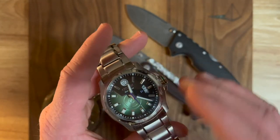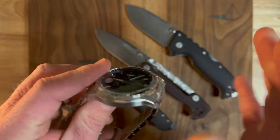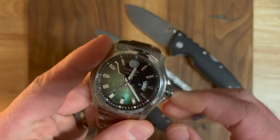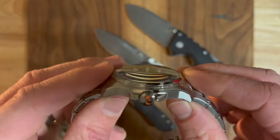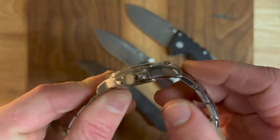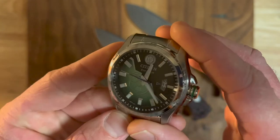I don't know what steel that Seiko used, but it may have been 304, which is a little bit less resistant to chlorides. It is still stainless, but it's not going to resist the acid effects that this 316L apparently is capable of doing.